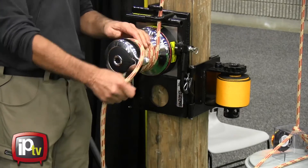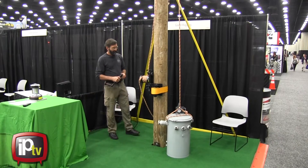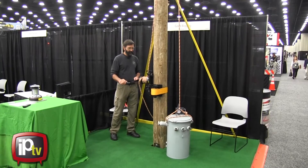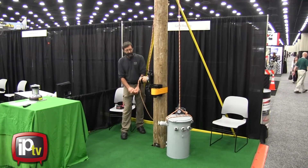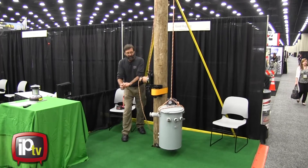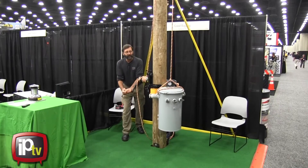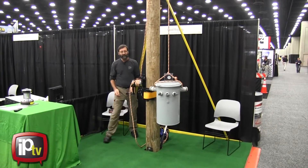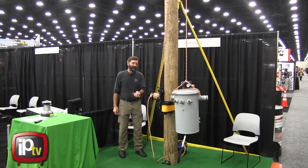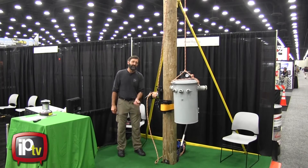Now that we're locked into the jaws, we need an input force. This winch can be hand cranked with the included handle, and the two-speed gearing system works by turning the handle clockwise — you're engaging the high-speed gear in the winch, which is a 4 to 1 gear reduction. Simply turning the handle counterclockwise engages the low gear in the winch, which has a 10 to 1 gear reduction.